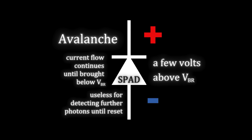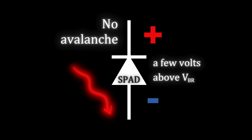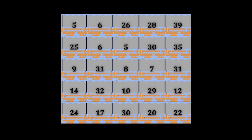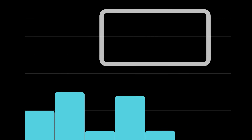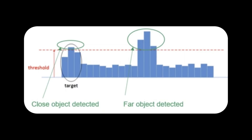Once this happens, the SPAD is done. It can't detect another photon and continues to let large currents flow until it's reset by being brought below its breakdown voltage and then back up above again. Since these avalanches can easily be triggered by noise, dozens of SPADs are used per zone so that the sensor's built-in microcontroller can generate a histogram from the data that your main one uses to filter out noise and detect up to four targets in the same direction.